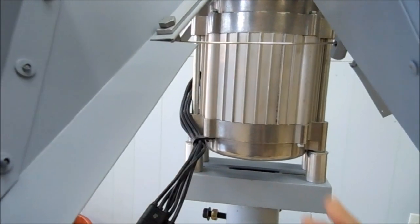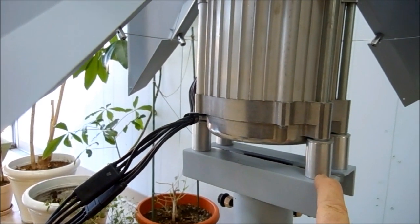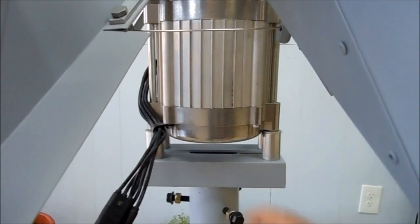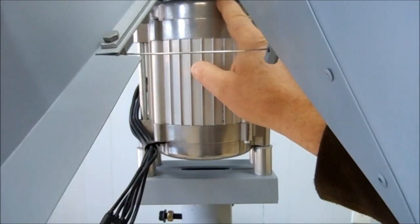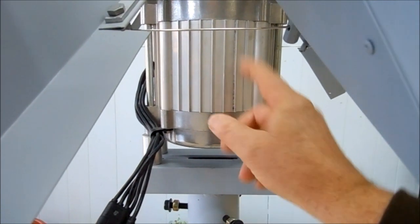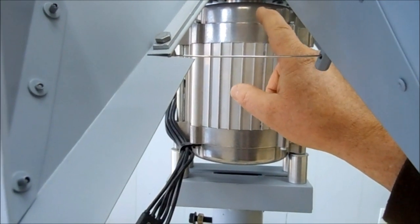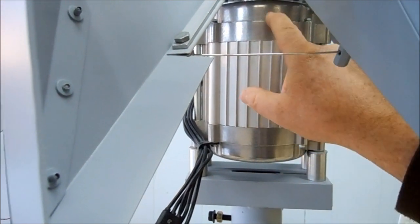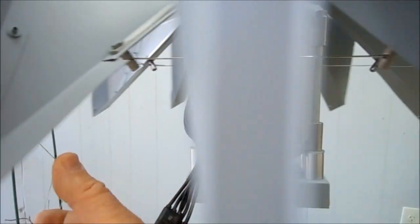The Freedom 2 has four mounting points — not like an alternator-type PMA. It sits on top of the pole solidly. It also has a stainless steel shaft that runs throughout the body, with a bearing in the back and a bearing in the front — not like an alternator where you have a cup bearing in the back. The stainless steel is important because the magnets are on the center shaft as the rotor. If the shaft is steel, the magnetism transfers through the bearing and slows it down. With stainless steel it doesn't interfere with the ease of turning the turbine.